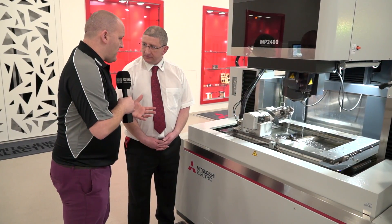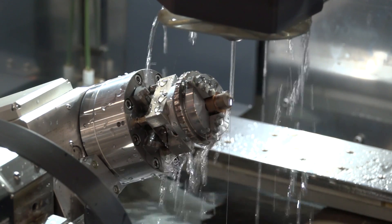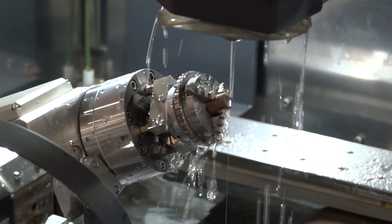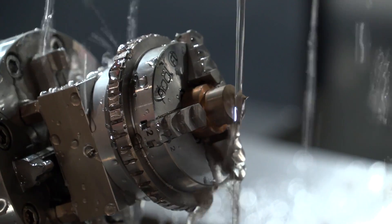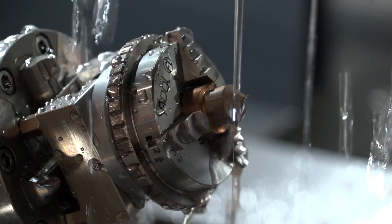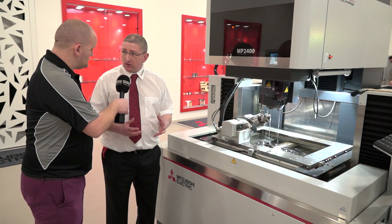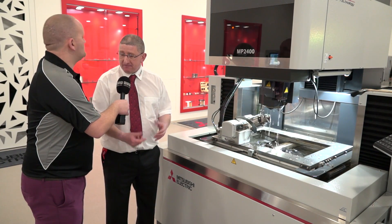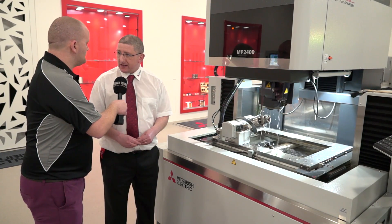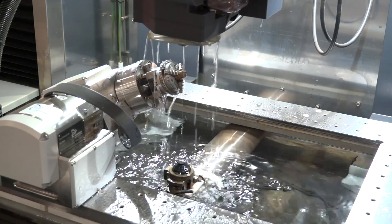The MP range has an addition of a fourth and fifth axis — though because we already have the U and V axis, Mitsubishi actually calls this the sixth and seventh axis. This is a standard feature on Mitsubishi machines, so all controls are ready for this technology. The customer can specify the axis type at purchase or add it later, plugging straight into the control with no factory option necessary.